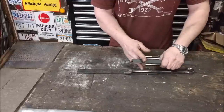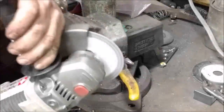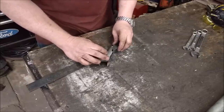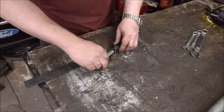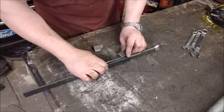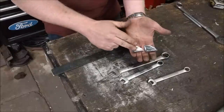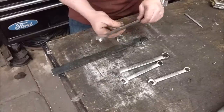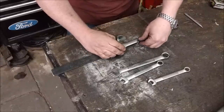I'm cutting off two little pieces of one-inch by one-inch angle iron. Essentially, one piece welds here and the other welds here, and the angles allow you to slide the wrench out easier. I cut the little leg off so it fits tighter, and I'm going to weld it on this surface. I got these two pieces all smoothed out — this one is actually a little bit thinner.